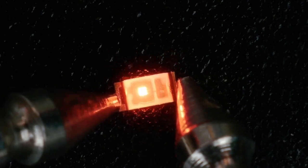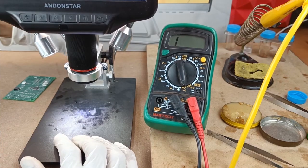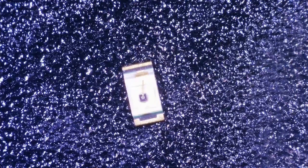And you can observe on the LED, now I have actually altered the polarity. The left hand part is bigger on the LED and the right hand part is smaller. So the smaller part is the anode and the bigger part is the cathode. This is how you need to identify which one is anode and which one is cathode in case of an LED, by putting the multimeter in continuity mode.